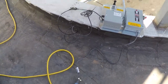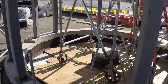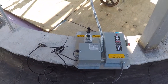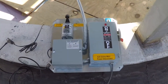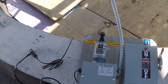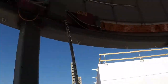Here's a quick rundown of the setup here at OU — there's the dome. I want to go through the setup for controlling the dome. Down here we've got the dome control box; this provides power for the rotation motors and for the shutters as well. To fire things up, this is plugged into a standard 120V — there's a switch right here we just need to turn on, and a little red light right there will go on. That will control rotation.